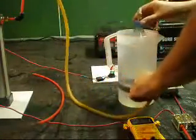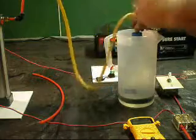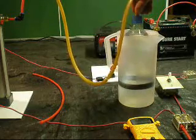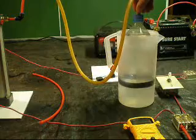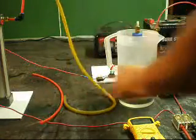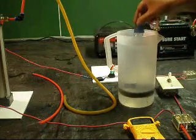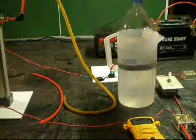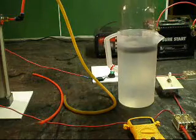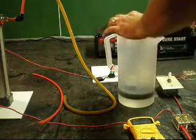I do like the design of this hydrometer. You can also use it to test to see how much leakage you have in the system — as you can see I do have some leakage. But it's much easier to build this than a lot of the hydrometers I've seen where they have to invert the bottles. This you just have to cut the bottom off the bottle and put a fitting on the cap. The other thing is that you can remove the cap and quickly get the hydrogen out.